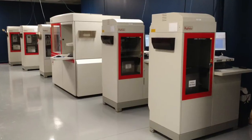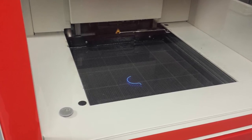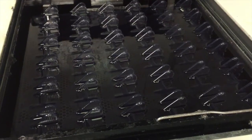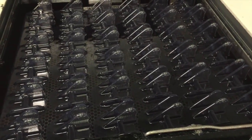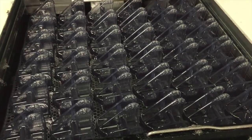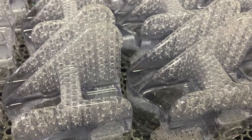Using stereolithography 3D printing technology, more commonly referred to as SLA, Realize has the ability and expertise to create investment casting patterns for foundries. Utilizing a highly specialized build style known as quick cast, foundries have access to an alternative solution to traditional wax patterns, which can be expensive and time consuming to produce. A quick cast pattern is an SLA model, but differs in that it has a thin skin that surrounds a matrixed internal structure.